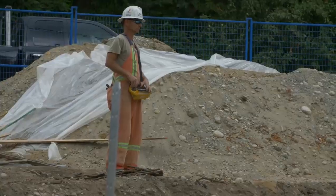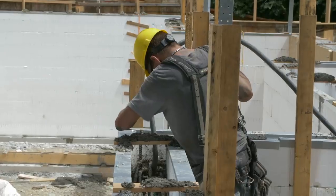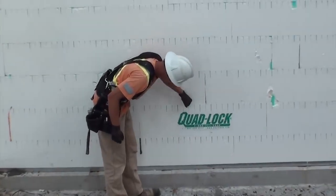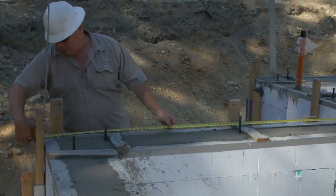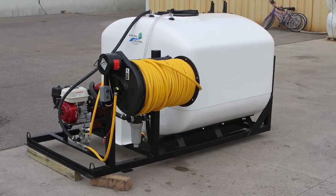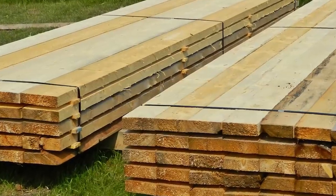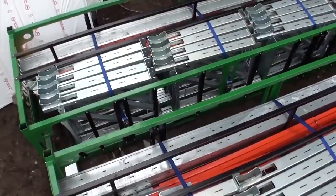Assign crew members to handle the pump, place concrete, run the vibrator, spot the bottom of wall for pour height and possible issues, and to check for quality control. Be sure that anchor bolts and other materials are easily available, as well as the concrete vibrator, water for cleaning, and personal protection equipment. Have plywood and lumber or metal bracing available to repair problem areas.